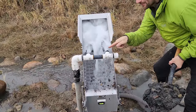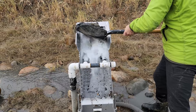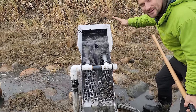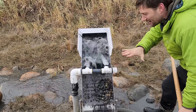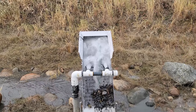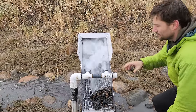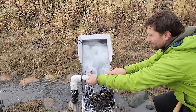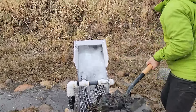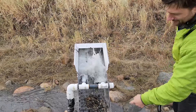Here I experimented by putting one spray bar up and one down just to swirl the material a little bit. Whatever material you're running, you just adjust the spray bar — the angles here are right dialed in. I think it washes best with these pointed down.